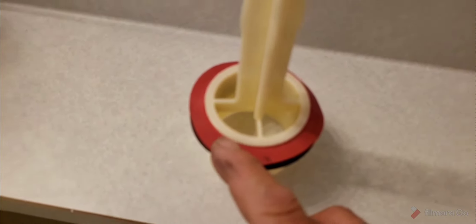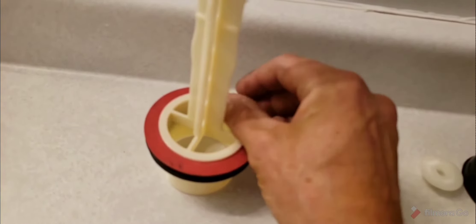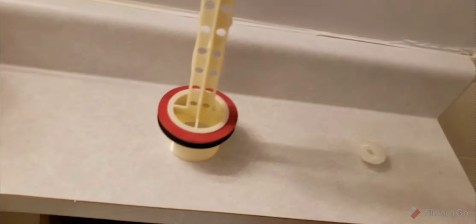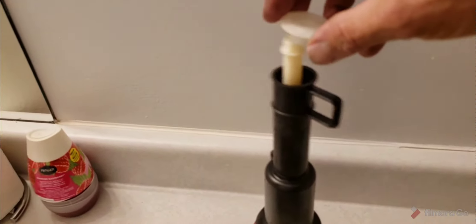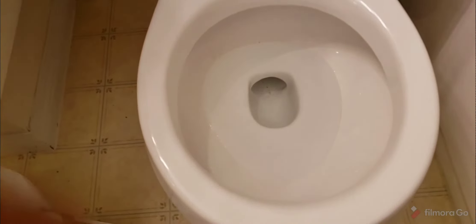Push this all back in here. One of the common problems is you put it in and — see this little edge here — it's not actually seated. So you need to work it up and down to make sure it seats well in there, because the bottom has the opportunity to push that down and create the seal. Then you just pop the top back on, and the whole unit is right there.